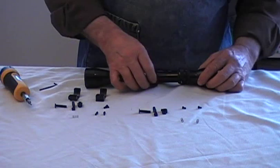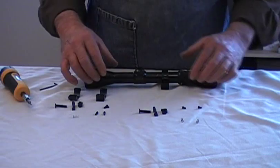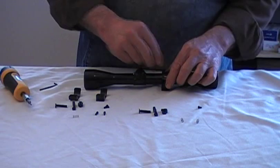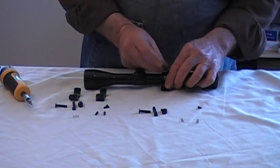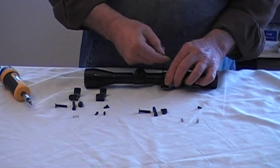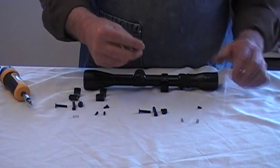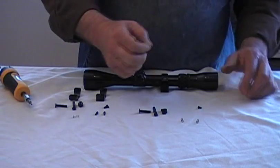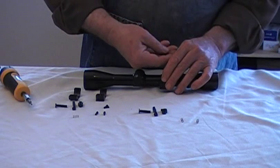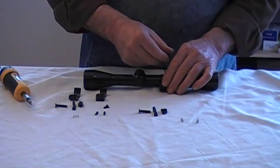You don't have a lot of room. You'll see the rings have plenty of play on the scope tube — don't worry about that, it allows you to adjust once you get it on your rifle. The top set of screws, just put them in there and do not tighten them all the way, just screw them down a little bit. If you don't have a torque driver, you can still do a good solid installation — keep the key seated, that's critical, and pull them up good and snug. Good and snug is not destructive. The torque driver will give you the best results in the long run.